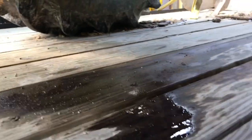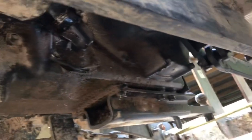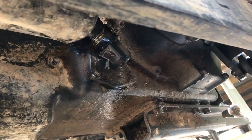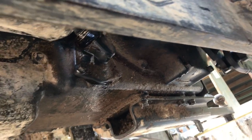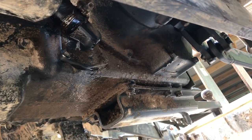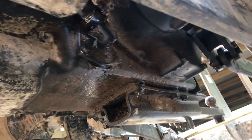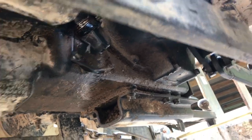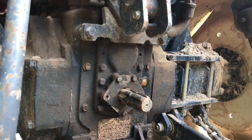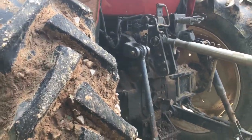I've got a little oil leak here — just got this last night. You can maybe see that elbow right there, that rubber hose. I was doing some mowing over some limbs and twigs and a stick jammed up there and poked it, so it's nothing complicated. I just need to find another little piece of rubber hose; it's not a factory rubber elbow because it's kinked, but I can just get a short scrap of hose and replace it. It's a little leak coming out of the transmission hydraulic system — no big deal. According to the sight glass on the back, we still have plenty, so I'm not too worried about that.